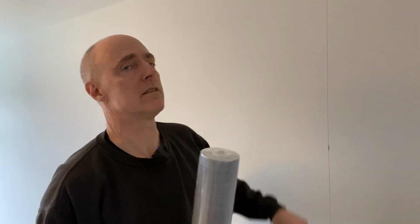All I need to do now is paste up the wall there, and then I can get the first sheet of paper hung. Now the beauty of this stuff, the paste-the-wall, no pattern match type of paper that I got from B&Q, is you don't even need a pasting table, or wallpaper table, because the paste just goes straight on the wall, which I'll show you in a minute. So if you're thinking, I'd really love to wallpaper a wall or two, but that means I've got to buy one of those pasting tables. Well, if you get this stuff or something like it, you don't have to bother with that. And I've just cut the first length to 2.4 meters, which is the length I need. I did that on the living room floor with the tape measure, and the first sheet's there, ready to go.